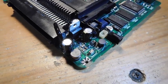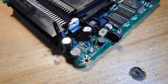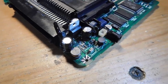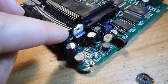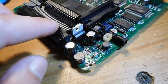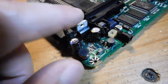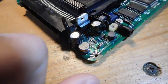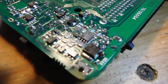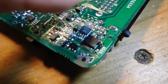Some time has passed and unfortunately replacing the capacitors did not get me a working PC Engine LT. I thought about what else could possibly be responsible, and one thing to consider is that maybe with time, or with damage from those capacitors, the power regulators on this board have gone bad. On the PC Engine LT there are actually two of them. There's one over here which I've already replaced — this is your standard 7805 voltage regulator, which takes your DC input from the power jack and converts it to five volts. If you flip the board over, you'll see there's also a little surface-mount chip on the opposite side in the same general region — this is all related to power management.